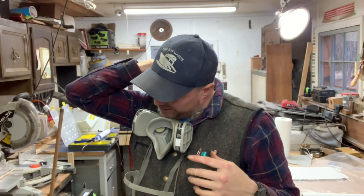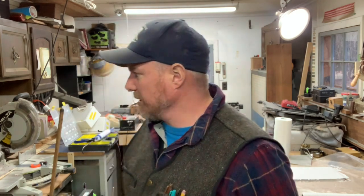That's going to do it for my time today at the shop. The Total Boat structural polyester repair putty is very comparable to Hull and Deck — it's got milled fibers in it and you can really gush it into spots to bring some rigidity back, because it's polyester and it laminates as well. We're going to use it on the inside corners, radius them, and then put glass all over it. That will be in the next video, coming probably next week. Thanks everybody for watching, have a very Merry Christmas and a fantastic New Year's Eve — please drink responsibly and tip the waitstaff!